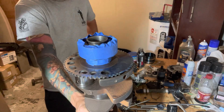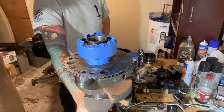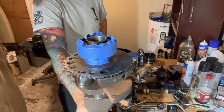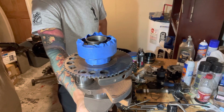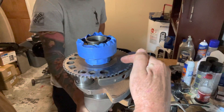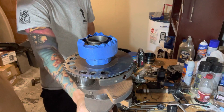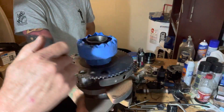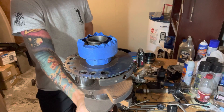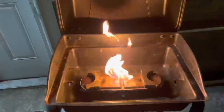The tool you normally buy — I think it's called Goodson — I'll put a link in the description. But if you don't want to buy the tool, you can do what I did. I used a barbecue grill with the jets rearranged to heat metal parts, heated it up on a propane grill to approximately 500 degrees. There's some heat discoloration on one side — I had that side to about 500 degrees, and the other side was approximately 220 to 250 degrees because I couldn't move the flame without cooling the first side. I kept the flame on the thickest part of the middle since that's what takes the most to expand.